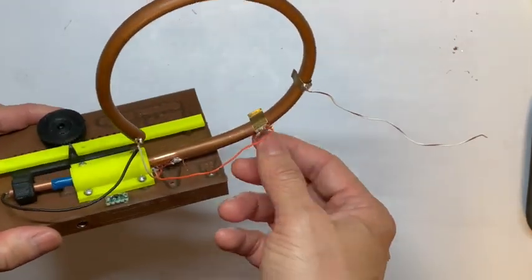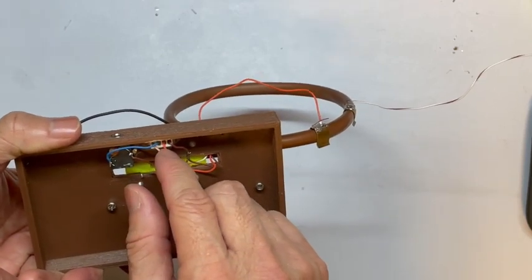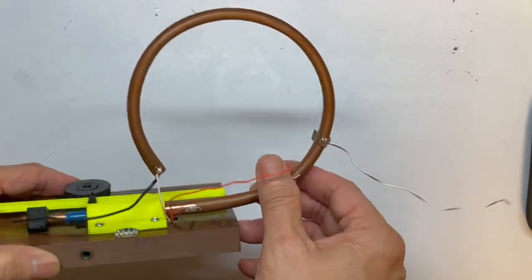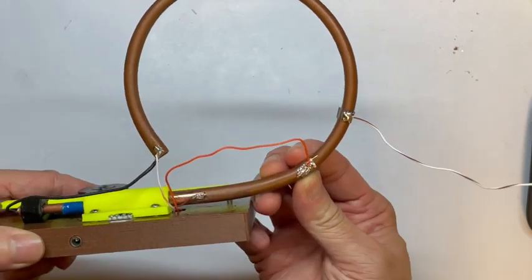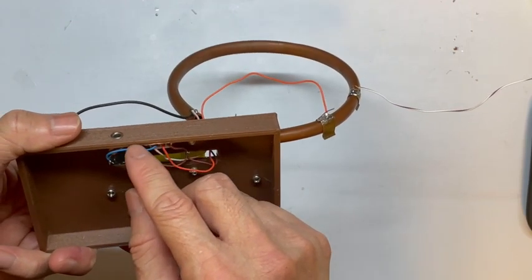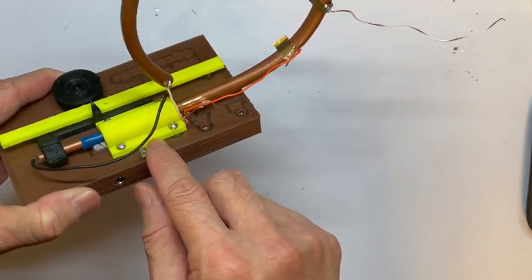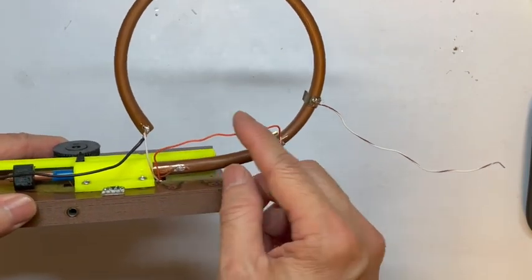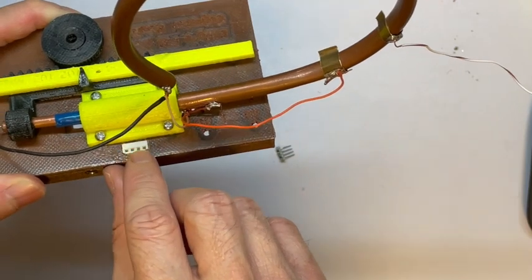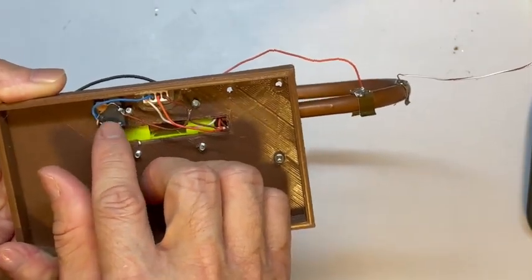The other thing we need to work on the coil is connect this clip, which is the orange wire. The orange wire is for the source of the MOSFET. The source will be tapping from the coil — the resonance circuit output will feed from the coil to the MOSFET source. Then it will do the slope detection and the output will come from the blue wire to the headphone jack. In case we are connecting a diode, it also works the same way. The diode will input from this orange cable, which is at the middle two pins of the socket. And then the detector will have output on the next pin — the blue wire — connecting to the terminal. So it's a very simple circuit that anyone can make.